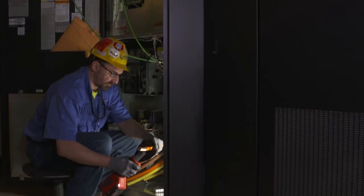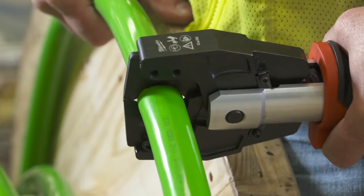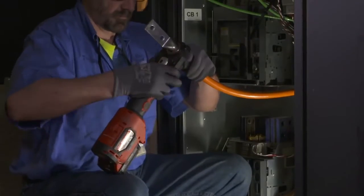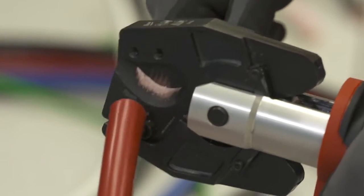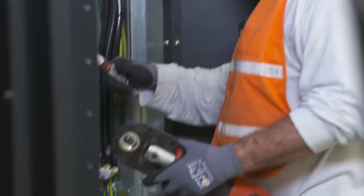With that M18 Cutter, I can get a clean cut for the termination, which is important. We've cut anything from 500 copper to 750 aluminum. You can change the angles of the head to get into different areas. The previous cutter would have it pinched and locked down and would have trouble getting it off the cable — this one goes right through the wire. We've had no problems. We're limited to our space in a lot of these cabinets and we've not met anything we can't do with that.